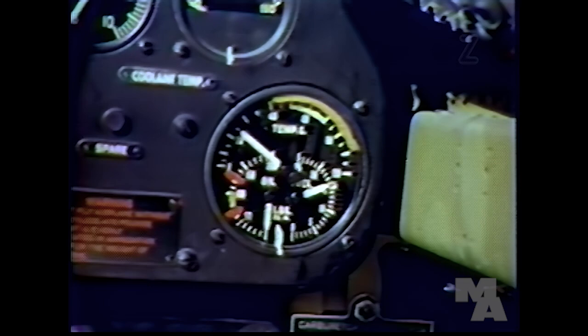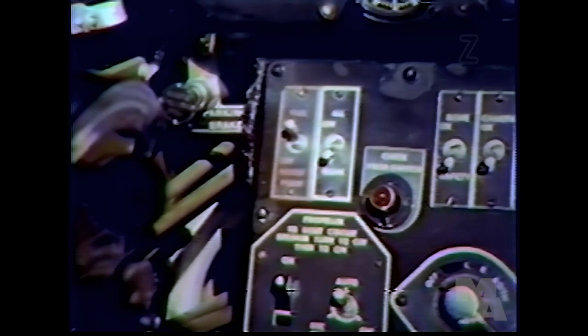15.5 pounds. Okay, then prime the engine. How much do I give it? 1 stroke for a warm engine, 3 if the engine's cold. Then shut off the fuel pump. Shut it off? Yeah, to keep from flooding the engine when you move the mixture control forward.